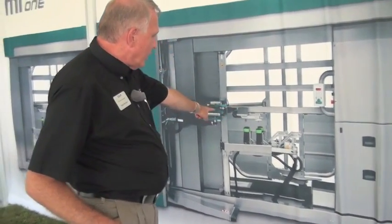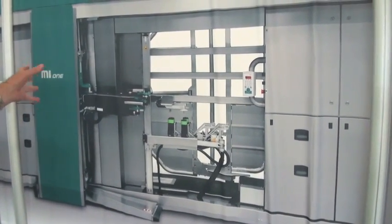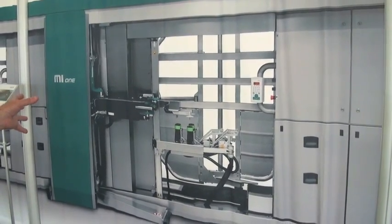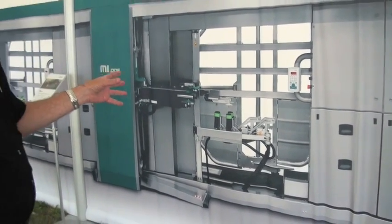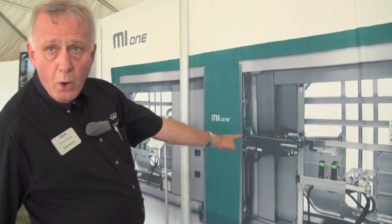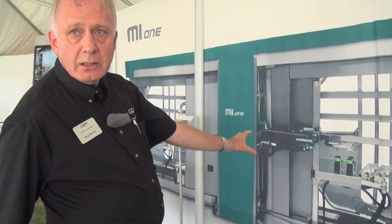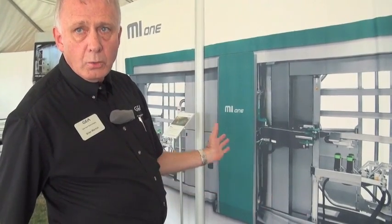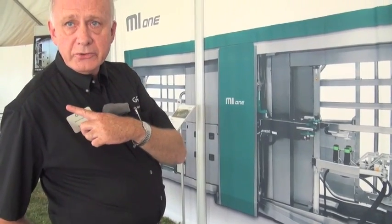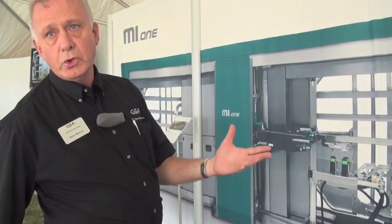With a camera on the arm — a pixel camera that's software driven — it positions the unit to put the cups on the quarters. We follow the Apollo system: we wash in the liner, dry the teat in the liner, then milk the cow all in one process. After the cow is finished, the Apollo system will dip in the liner and do a true back flush.